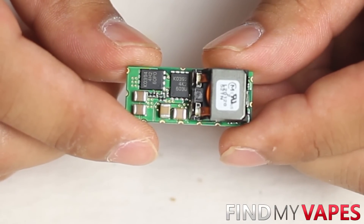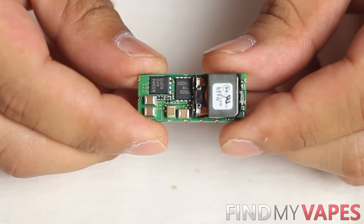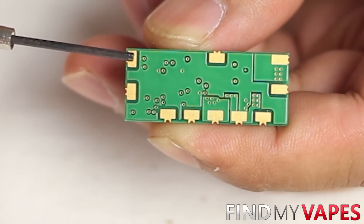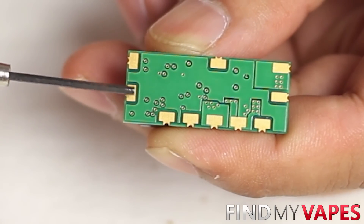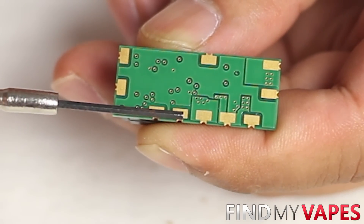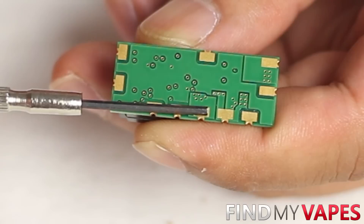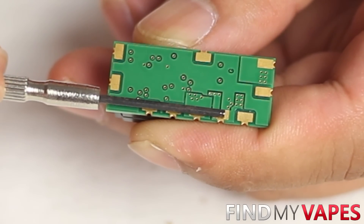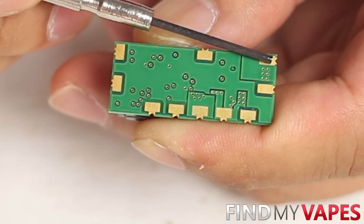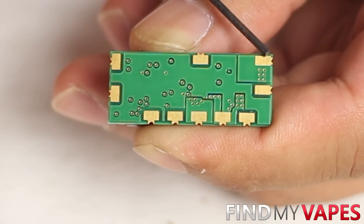Here's the OKL T20 chip. I've created a wiring diagram for you to follow along — a link to the diagram is provided down below. All of our wiring will be done on the back of the chip. The on/off pad connects to both the master on/off switch and the fire switch. The negative sense pad connects to ground, and the positive sense pad connects to voltage out. The trim pad connects to the potentiometer to regulate voltage. The voltage out pad also connects to the positive pin of the 510 connector, and the ground pad connects to the negative contact of the battery sled. The voltage in pad connects to the positive contact of the battery sled — but first it goes through our PFET for reverse battery protection. We also need a 20K ohm resistor connecting the on/off pad to the voltage in pad. Start by tinning all the pads using flux and solder.